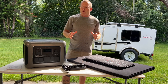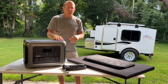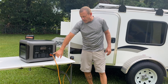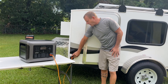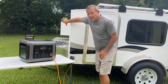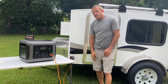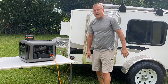They're meeting that price point. So let's test this out on the camper. We have it set up right next to the unit with a short extension cord plugged into the 120-volt 20-amp outlet, and this is plugged right into the 120-volt 15-amp inlet on the RV. You can see the AC unit on the outside. Everything's set up for this shore power hookup — we're going to go ahead and turn the air conditioner on and prove that this unit will run it.